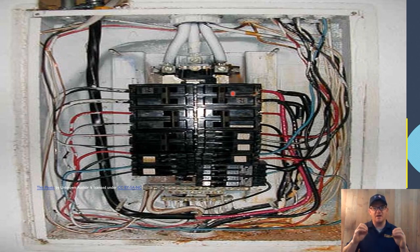One reason this is going to happen is because of air exchange. This pipe right here — it may come in on your house here or here or somewhere in this scenario, or come in the side. This is leading to the outside electrical meter usually, or some outdoor electrical panel. You may be at a sub panel in the system, which is some of the other reasons we're going to talk about. This pipe, if it is a pipe at your home, is going to be exchanging air with the outside. If it's not been sealed up — and nowadays we seal them up for this very reason — there are several ways that water can be getting in, but this is one of the main ones.